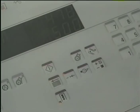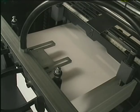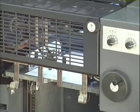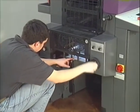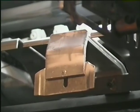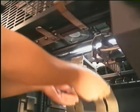Press the button for double sheet positioning run twice again and the sheet will be transported to the delivery. With the crank handle, you can now set the rear sheet stop of the delivery to the format size. Please remember that the rear stop may have to be removed for small paper sizes.